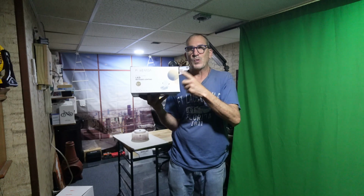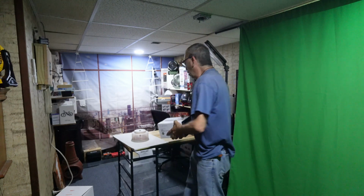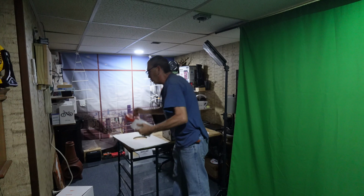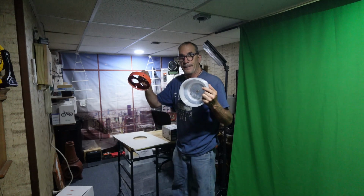1000 lumens, 9 watt, 50,000 hours of life. It is a recessed light with a gimbal, 360 degree rotation in different Kelvins from 2500, 2600 up to 6000, controlled by the switch that you wire up 110 volt AC to the ceiling. You're going to be cutting a hole out with a recess tool for your lighting.